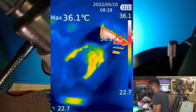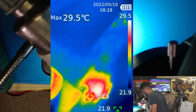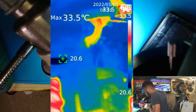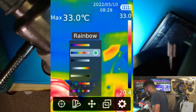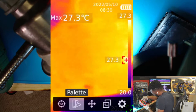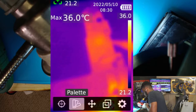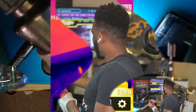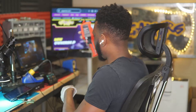Let's go over to the thermal camera. I have it plugged into power and I don't see absolutely anything running too hot. I just plugged in the battery to see if that will jumpstart anything — looking all over the place, I don't see anything. Let's change our color scale to iron. I don't see any chips or anything getting too hot on this board. Everything seems stable and normal. No obvious shorts, nothing getting extremely hot.